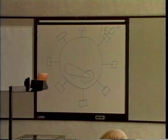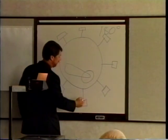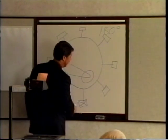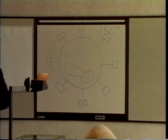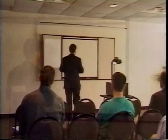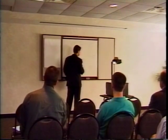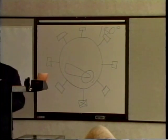The rule of thumb then is the heaviest spot will be your fastest position. So you go to your fastest position, say this is our fastest position down here. Now the next part is the most confusing: we want to identify this on the balance wheel so that we take the weight off in the exact spot that we need to remove the weight from.